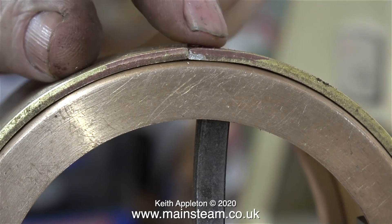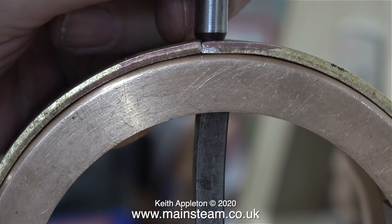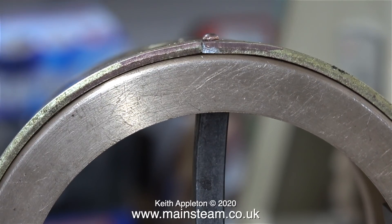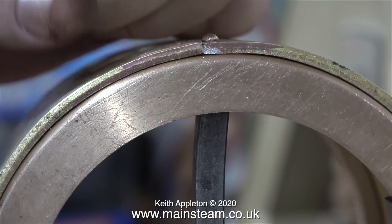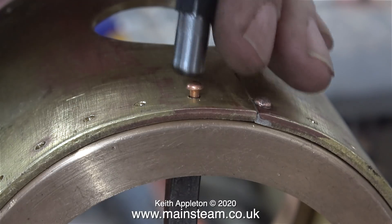I'm starting on the underside to see what it's going to be like, and if I make a mess of this it doesn't matter because you can't see it when it's fitted to the engine. Initially while doing this riveting job I'm only putting enough pressure on the rivet head to make it seat in the hole, and once I have rivets all the way around the edge of the smokebox I will go around the job again and tighten them up by hitting them one more time with the rivet snap.